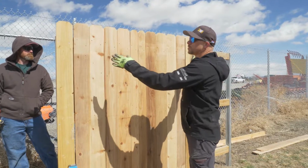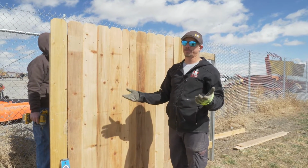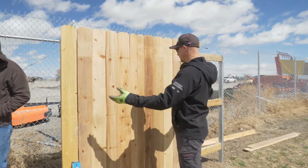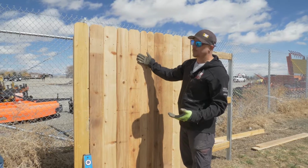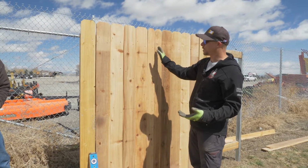This spacing was just set random. It's not a 48-inch gate, it's not a 36-inch gate, it was 51.5 inches. And so when you have some random spacing, which is usually what we do because we just set our post randomly, wherever the center of the hole is, knowing that it's gonna be about 48 inches. Inevitably, even if it was 48 inches, we'd end up needing to trim a picket.